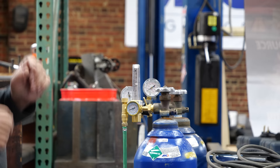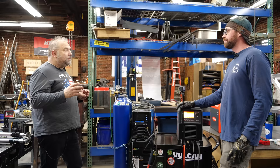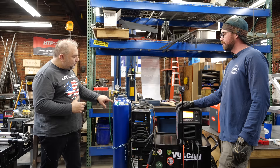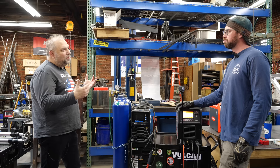So what I found with these — I made a test rig, a special line. I went to a calibrated gauge and tested. This whole test started for pulse MIG aluminum, where some people just had problems with that style — I call it a single-stage flow meter. When the tank pressure is at 2200 when it's full and I set this to 40, bottom of the ball at 40, and ran this through my calibrated gauge, it was showing 40, 42. Within reason, within spec.